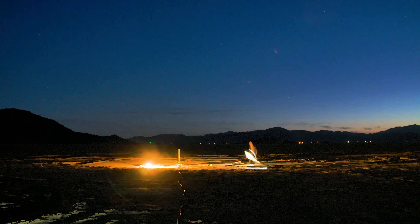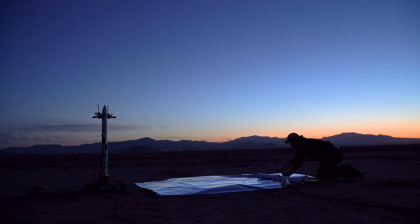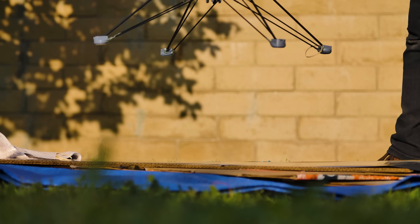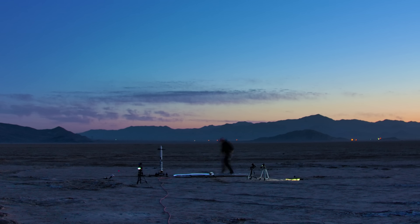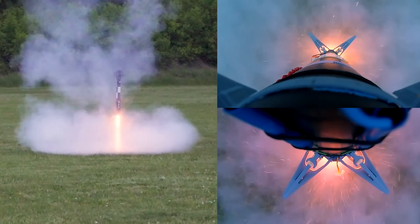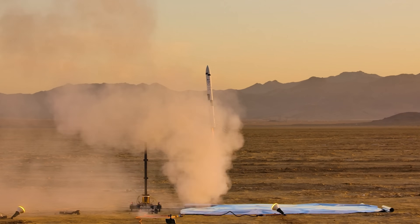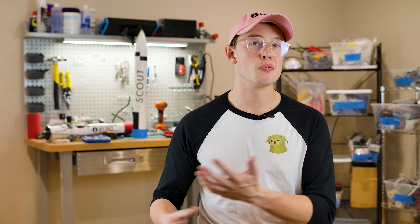It's actually a few things. First, I lay down a tarp, and then a few layers of cardboard on top of that. On top of that goes a rug, and on top of that goes a layer of mylar film. During testing with the landing legs, I found that cardboard did an excellent job of dissipating the energy on impact without making the rocket bounce. The bounce has been a pervasive issue. The tarp helps a bit with that too, and the carpet on top was a last-minute idea to smooth out the bumps between cardboard pieces. The mylar layer on top lets the rocket slide when it touches down. Slippery surfaces make really good landing pads — bumpy surfaces like grass or dirt let the rocket dig in, and any horizontal slide on touchdown turns into a tipping moment.